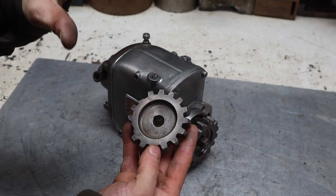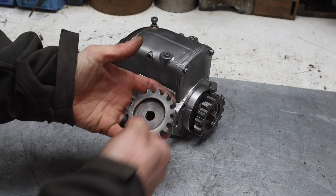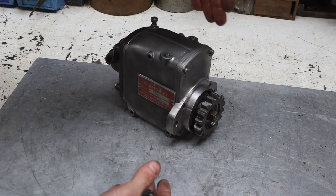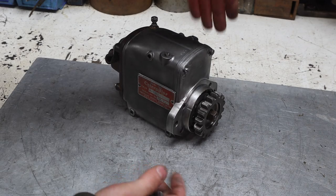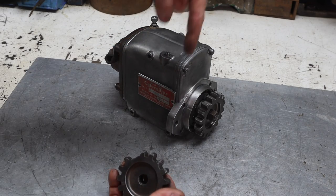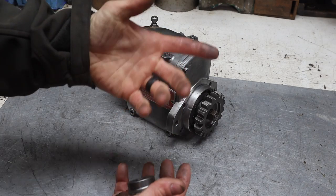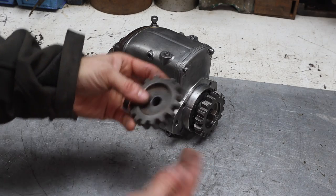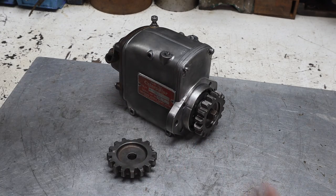Most likely what happened is there is play in the crankshaft. There's a bearing on the front side of the engine. It's basically the furthest toward the front of the tractor that can go bad. And at the very top of it, there's a pin that retains that crankshaft. What can happen is that pin either pops out or gets ruined or gets stripped out. And so, as much as I don't want to tear everything down to get in there, I'm going to.